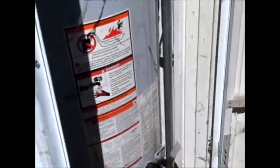Let's see if I get out of the shadow here on the gas line. And it acts as a trap for any dirt that you may have. They do have a shed here, and there's supposed to be 2 vents for combustion air to come in. So a couple things here that are not done correctly. No gutters around the house roof line, and you have a 6-inch newer block wall here.